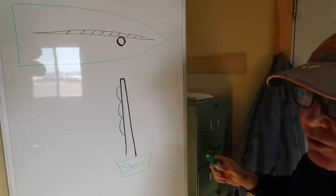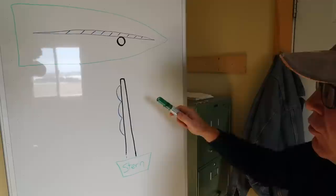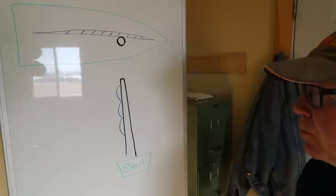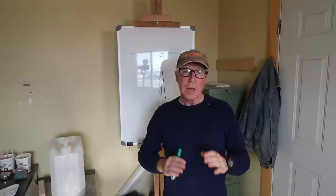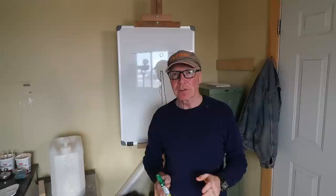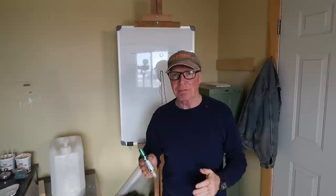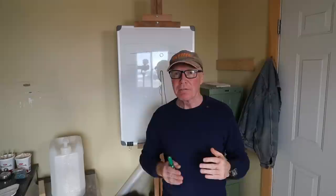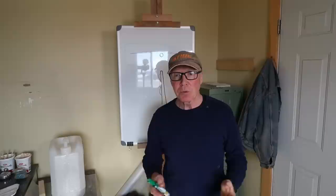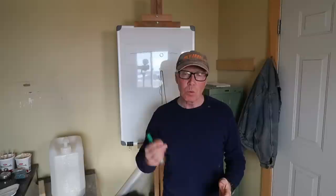So in theory, that's how a cambered sail works. In reality, it's a whole lot more complex to try to get this efficient shape — it takes experimenting and tweaking. When you get this right, you should have a sail that will perform better in light airs and to windward than you would with a flat cut sail. But when the wind gets up to about 10 knots, both sails will be performing about the same — perhaps the flat cut sail doing better at that point. I'll be taking a flat cut sail on the circumnavigation, so let's look at what flat sails are and what differentiates them from cambered sails.